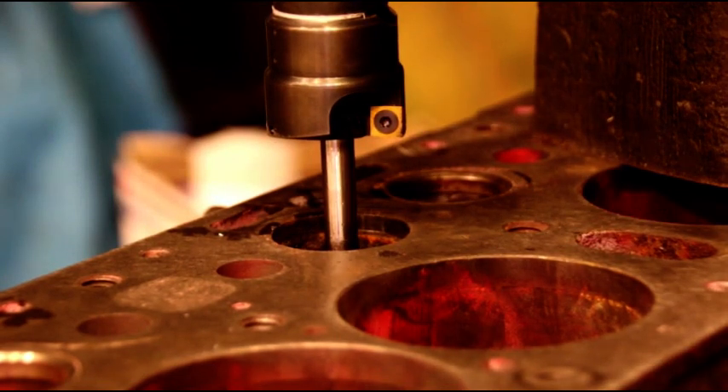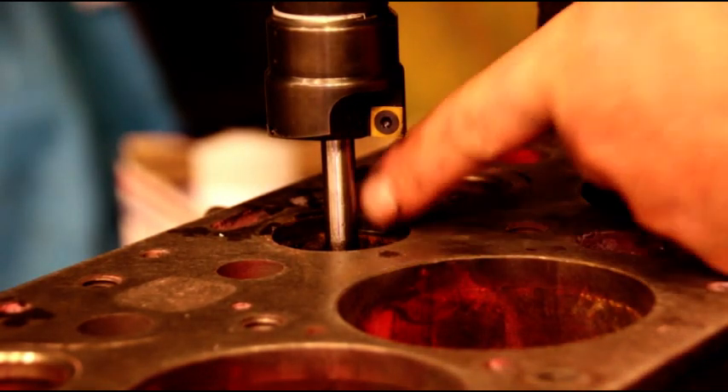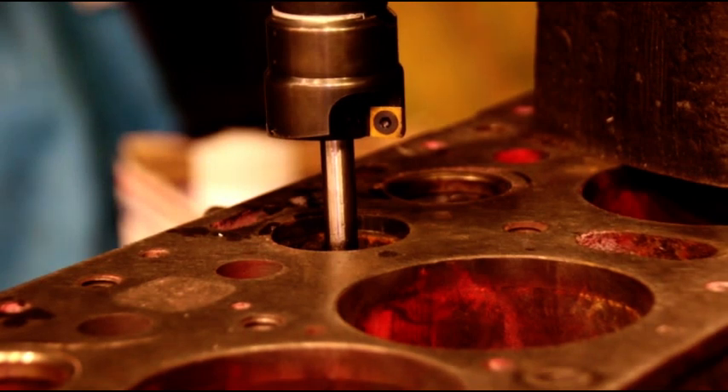We're starting to cut nice. I'm just going to pick it up and down every so often — when we take the rust off the bottom shoulder we'll stop. It's hard to see, so I'm just going to feed in a little bit, pick it up, check it, and go back in again. We don't want to go too deep — we don't want that seat too deep in there.